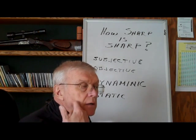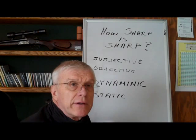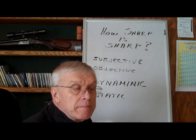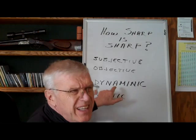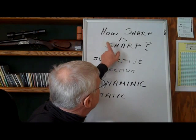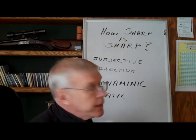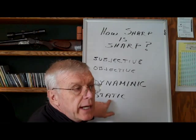When we shave a whisker off our face, we use a static method of shaving. The blade goes straight down — we don't saw with it. So consequently, a razor that we shave our face with is extremely sharp. It is statically sharp, rather than just simply dynamic sharp. So what I'm trying to explain here is what we want to do is measure sharpness objectively — try to put a number on it, if possible, like the number on hardness of steel, the Rockwell scale. And also, let's try to measure sharpness that is static rather than dynamic.